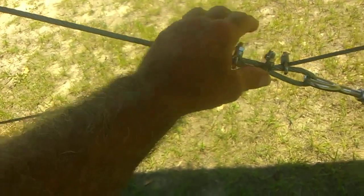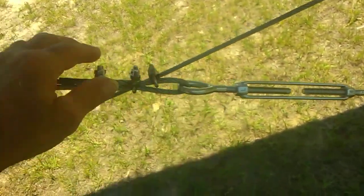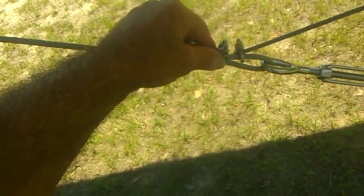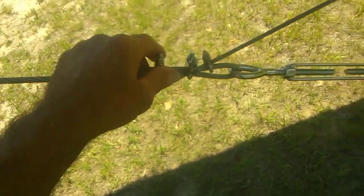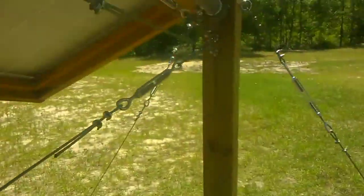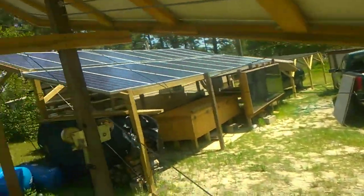As far as the cables go, maybe one clamp would have been good enough, but I just wanted extra insurance — so every end of the cable where it joins into a turnbuckle is double clamped, so there's probably not much chance this is going to come loose. Every guy wire you put up here, you want a turnbuckle on it so you can adjust the tension so that everything's perfect. It also works to level the post in each direction — turnbuckle on every cable.